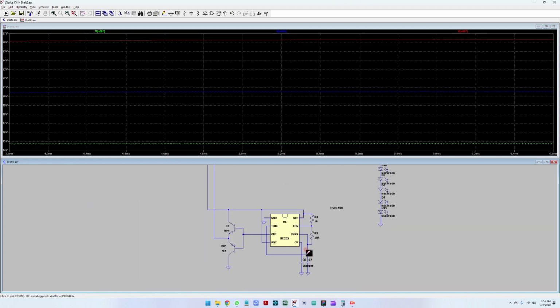Okay. The second circuit that we're discussing here is an astable circuit for a 555 integrated circuit. So this circuit works as follows. It charges this capacitor here through R1 plus R2, and then it discharges through R2, and then it constantly goes between charging and discharging this capacitor. The actual calculation you can find in the calculator. It's quite simple to use. This will generate almost any type of PWM you may need, and it's a quite versatile circuit to do a PWM output, and it's quite simple.